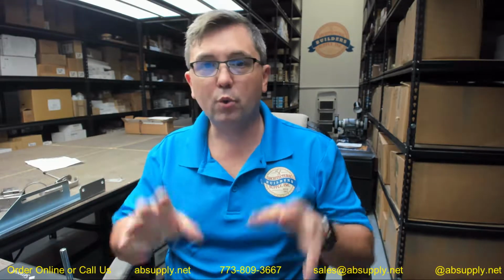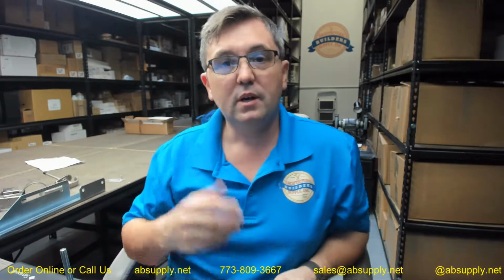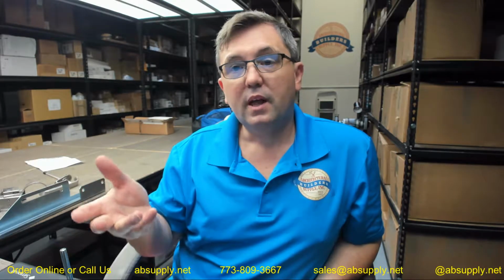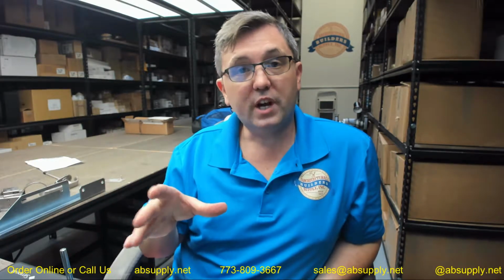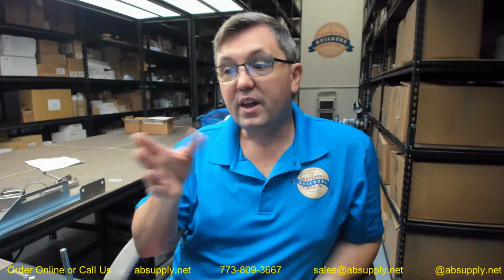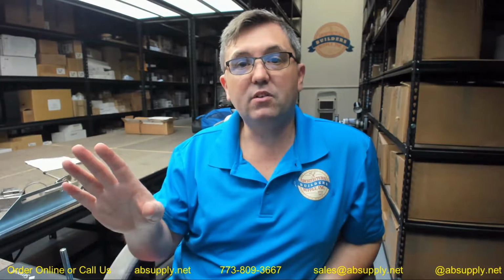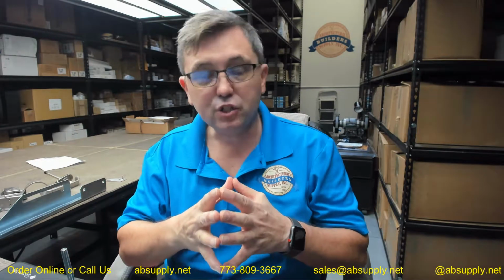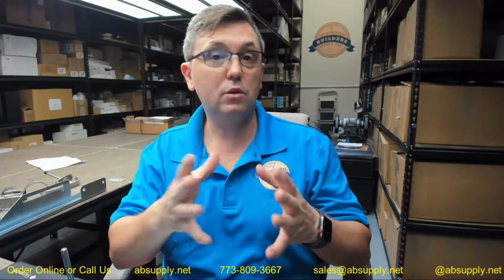If you are unsure, or if there's any doubt, send us an email. Send us photographs of everything. Inspect the sidewall for a name, a decal, a serial number. And if we can get that information, we can generally identify it. And then hopefully contact the manufacturer and ask for a bill of material, or at least a verification of what that unit would have been built using, to determine, yes, this is or this is not the proper hold open arm for your application.